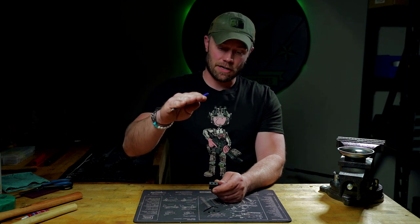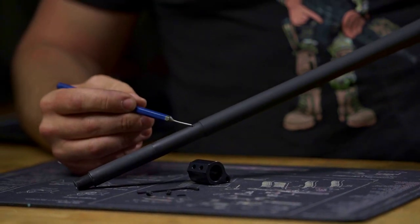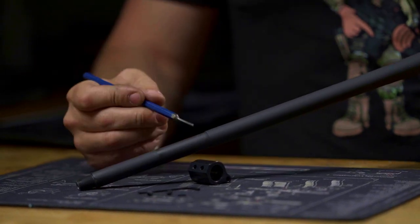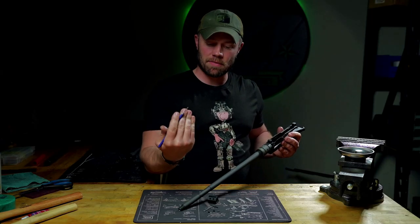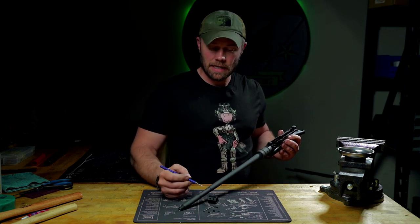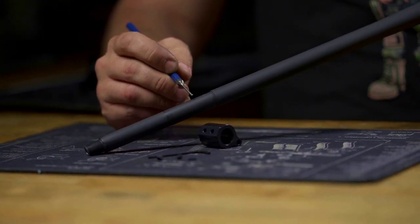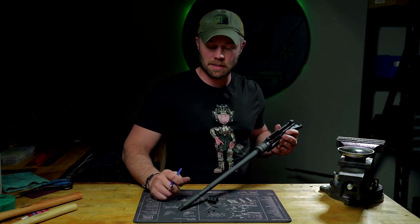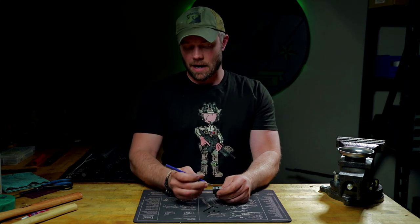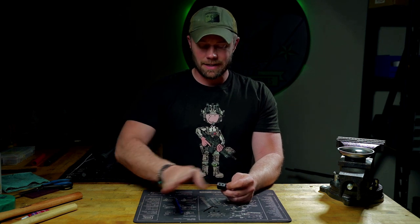When mounting a low profile gas block, the rear set screw will appear to sit deeper into its space because the dimple from the manufacturer on the barrel is where the set screw actually interfaces with the barrel — it gets to sit down into that depression. This allows the set screw to bite into a little depression, which helps keep things from rotating left and right and potentially sliding forward. The front set screw presses against a smooth surface as added security and insurance, and the raised ledge ensures both screws are completely housed with good thread engagement.